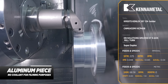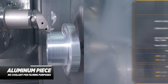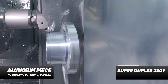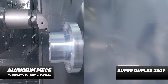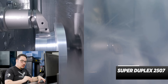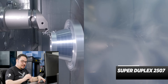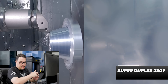I turned down everything, so we're going to be running it at 225 SFM with a feed rate of 8 thousandths per revolution. And the depth of cut is turned down also — we're going to be running a 45 thousandths depth of cut, still leaving 10 on all surfaces. I'm starting off roughing the OD, and after all the OD roughing is done, then I'm going to face the front of the part. That's only because I just wanted to face it when there's a smaller surface left over instead of having to face the bigger OD from the previous operation.